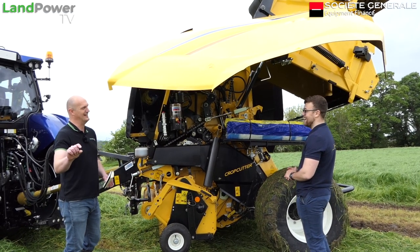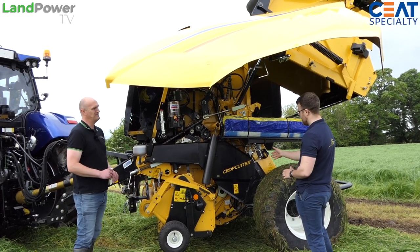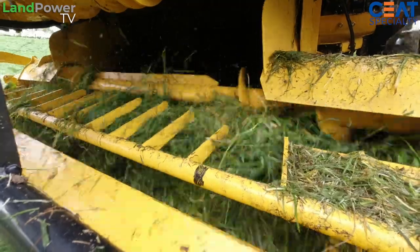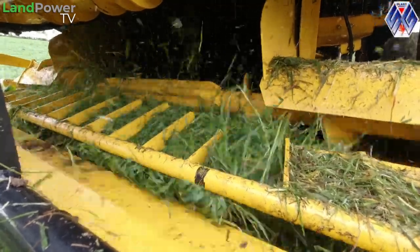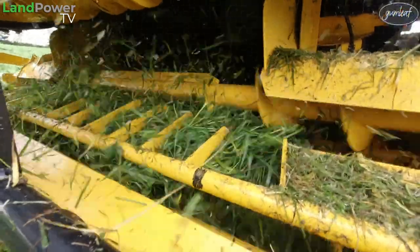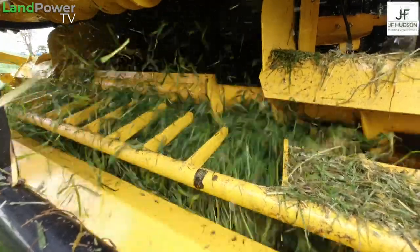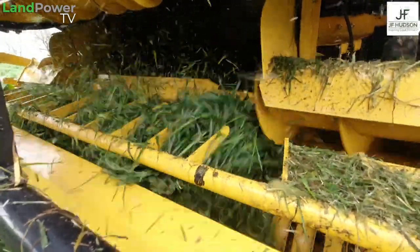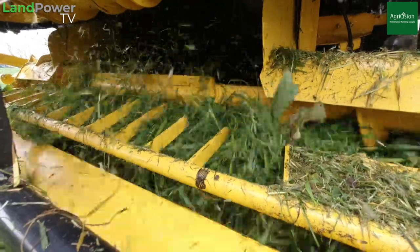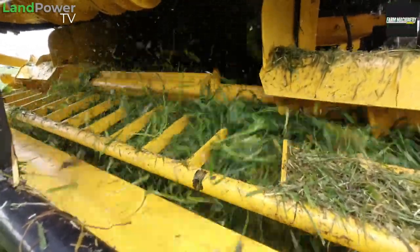That's what it comes up with. Exactly, that. Off a little bit, but yeah, so it's active, spring loaded, always working, and the knives are hydraulically protected, so it's a hydraulic knife bank. Right. So you've got two accumulators on either side, so it's not an individual knife protection system anymore, it's hydraulic, so if a big object comes in, for instance, it'll drop the knives ever so much, just to allow the lump of grass through.